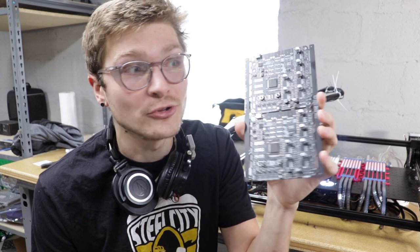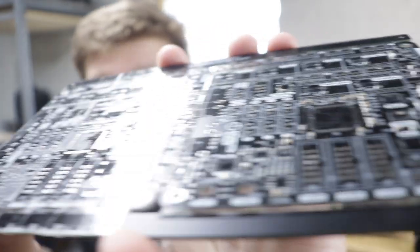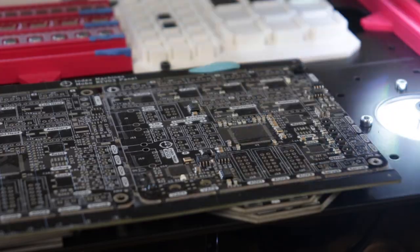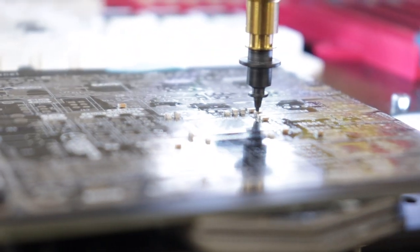So, how do we get to the point where we're able to populate this entire panel? First off, it was a lot of calibration in OpenPNP. There's this awesome trick where if you put a little bit of double-sided tape onto a board, you can go through the entire picking and placing process, and your chips will stay exactly where they're placed by the machine. You don't have to deal with all the messy solder paste, and you can test over and over with that board — it's really good for getting all your calibrations dialed in without committing to soldering. Step one was spending about two weeks configuring OpenPNP to work with the Index and getting it to populate parts on this tacky sticky tape board.